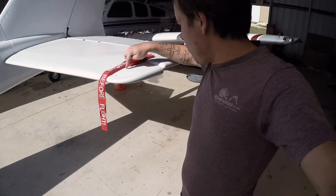What you just saw me shooting in here was something called a Cherry Max rivet. For lack of a better word, you can go to a gun range cheaper than shooting these — they're about 70 cents each for the ones I was just shooting; this 5-3 here is a dollar 20. They're not cheap. Essentially what they are is an aircraft blind rivet. There are some places on aircraft where you use non-structural ones like you'd get at a Home Depot, but these — the stem actually locks in place. There's a little snap ring that grabs it so the metal stem cannot come back out.